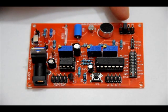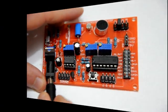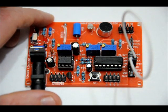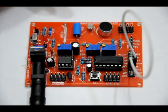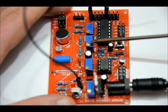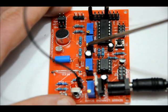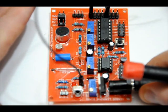The first thing you want to do is take your two-pin jumper and connect the two LDR pins on the sensor selection pin block. Next, plug it in. Then connect the AC pin on the main pin block to the A1 plus pin — they're side by side. Now we have our AC-coupled signal line from the light-dependent resistor connected to the amplifier. Next, connect the A1 out pin on the main pin block to the LED pin. I've taken a flat-head screwdriver and tuned the gain-one resistor by turning it clockwise 10 to 15 times.